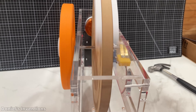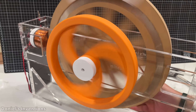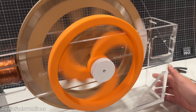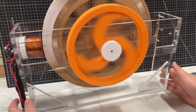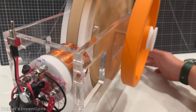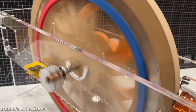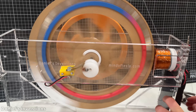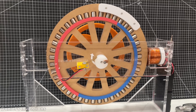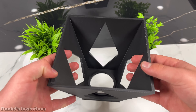Power can be extracted from the motor mechanically through a pulley, and the back EMF or the collapsing field energy of the motor can be arranged to power a load or recharge its own batteries. Two diodes were installed to rectify the collapsing field energy. I'll attempt to power a load of a strand of LEDs. The voltage input is around 25 volts DC, and the current input is very low, which allows the electromagnet to stay at a low temperature while performing work.